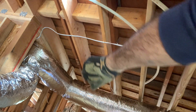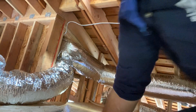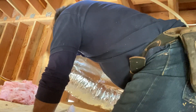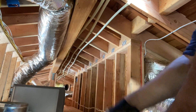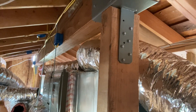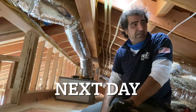So what I did — I asked them to give me some soffits at the corners: one there, one there, and one there, so we can run most of my ducts from outside of the attic and still have access to that unit. Some ducts are not going through there. Here is clear to get to the furnace and work on it if you have to do repairs. We also ran another duct from here, above the unit, so we can keep the unit area clear.